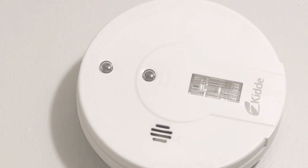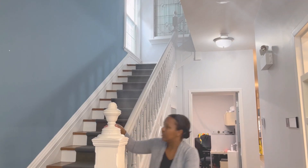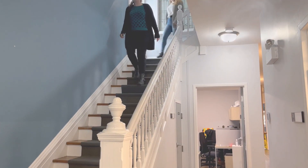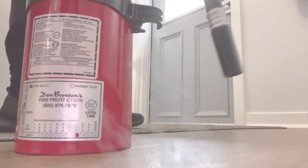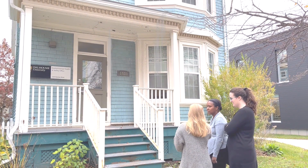If you are in a building, activate the alarm system first and assist anyone in immediate danger. Only after these two steps are completed should you attempt to extinguish a fire. Only fight a fire if it is small and contained. If you cannot put out the fire, or if the extinguisher becomes empty, get out of the area immediately and call 911.